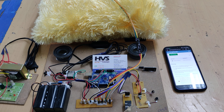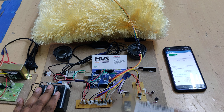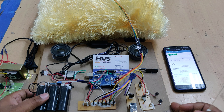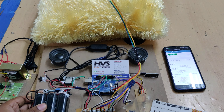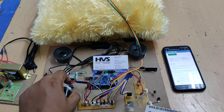The whole system is powered from a 12V, 1A rechargeable battery. Since the operating voltage of all modules is 5V, we have placed an LM2596 voltage regulator which takes 12V DC input and provides a constant 5V DC output.